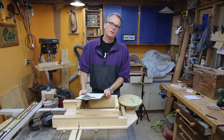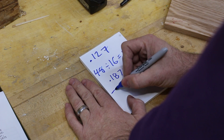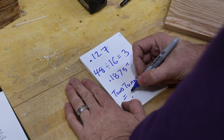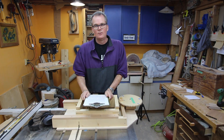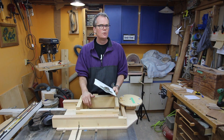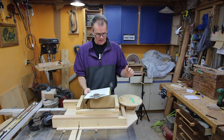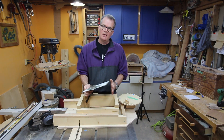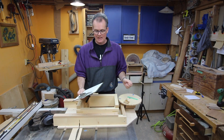I looked at that 0.1875 and the 0.127 number and they just weren't really working for me. However, it occurred to me that if I turn the gear twice that gives a movement of 0.375 inches, which is pretty close to three times 0.127. There are other ways you could make the math work. Anyway, I did two or three test joints and ended up with the setup where I would make a cut, turn the gear eight teeth to make a slightly wider cut, then turn the gear one and a half times, and repeat that process.